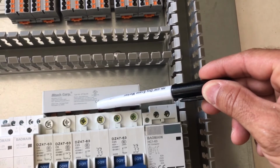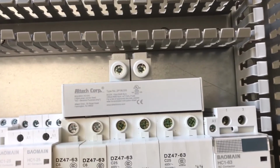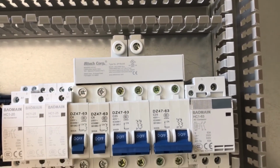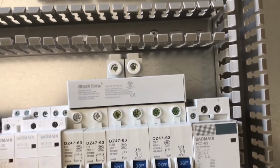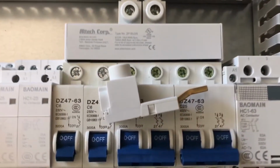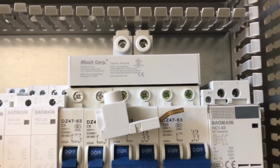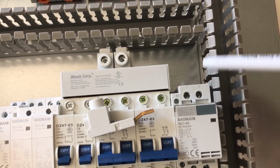But now you might ask, well, how do I get the power from the contactor into the bus bar? And for that, we'll use a single terminal lug. Here's a look at the terminal lugs installed together. And now you can see why we shifted the high voltage rail a little bit lower in between the wire duct to accommodate that single terminal lug. And these lugs look like this. And you can see how it sits underneath the bus bar and that tab meets together inside the breaker.